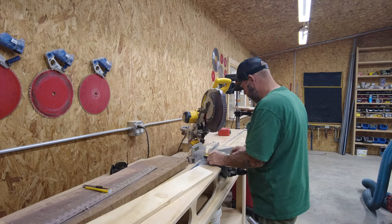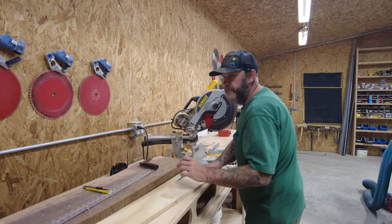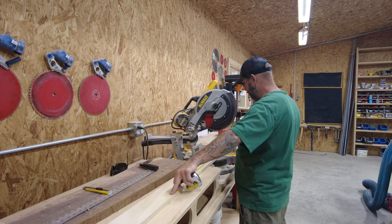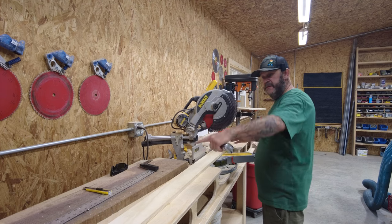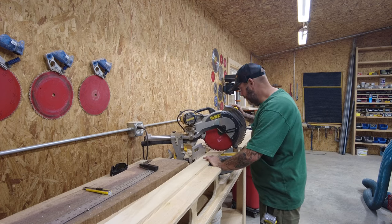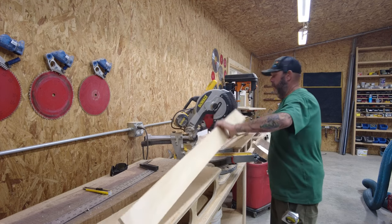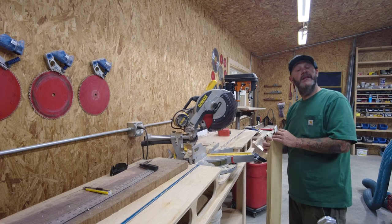So what I'm gonna do, set my chop saw to the same angle as the bevel gauge. Then I'm going to take this piece of lumber, and because it's 8 foot long, I'm marking 48 inches. And I am marking 48 both the center this way and the center this way. Now I'm taking this angle. That'd be perfect because we're going to cut it again. But I'm gonna make sure this blade intersects my hash marks. Now I have two pieces. With that, man, it's more perfect than I thought it would be.